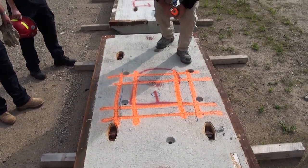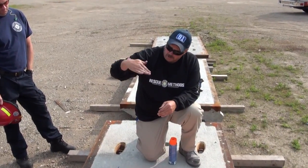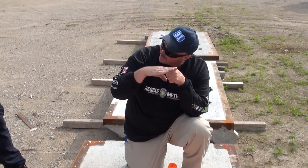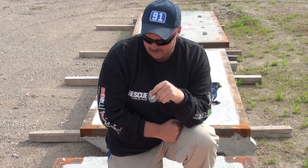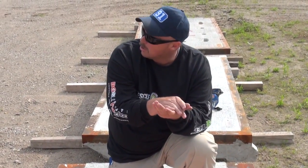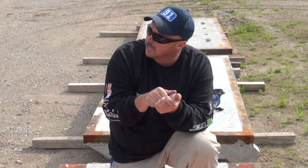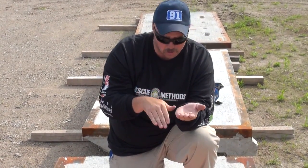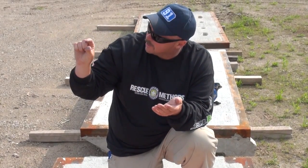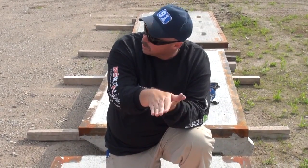Just like when you're cutting a roof, you want to make sure those cuts overlap. When you look at your blade, make sure your depth is at the bottom of your blade, clear past this cut — take that full depth all the way past. It's a little different when we cut concrete: we bury the blade all the way to the bottom, clear to the hub. Because when you start pushing the saw and it rides up and down, the concrete ends up being held by only a half-inch piece. You have to get that same depth all the way across.